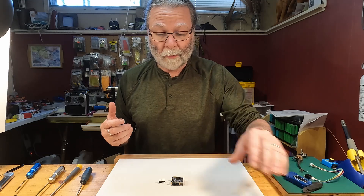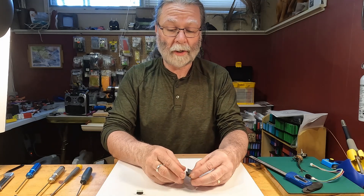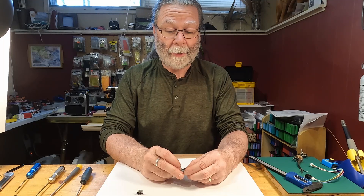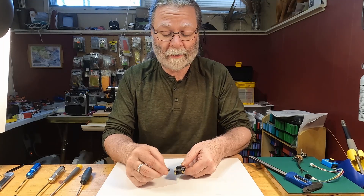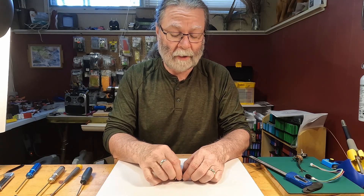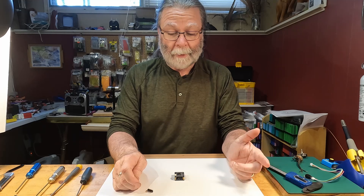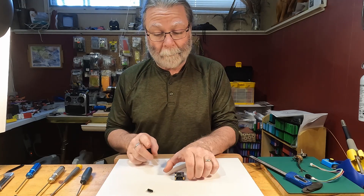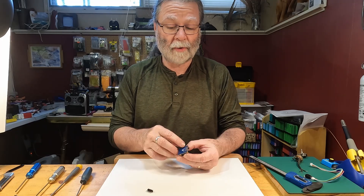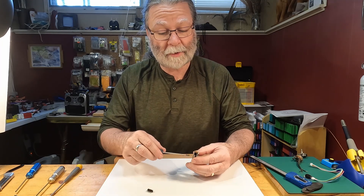What we need to do to get this ready is solder on the battery connectors and the ESC connectors. Over here in the front, we'll also connect and use the pin connectors — not strictly necessary, but I'd like to put them in for simplicity going forward. Most of the work will be on the bottom of the two boards, so I'm going to disconnect it and separate them.